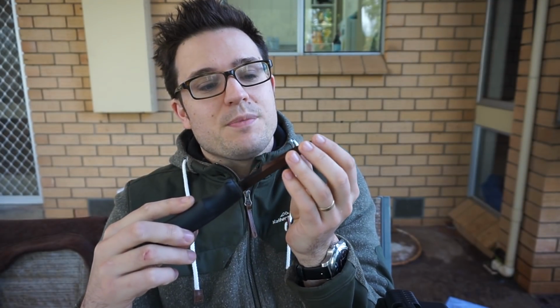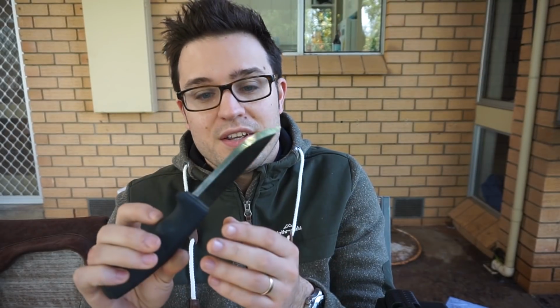Yeah, I'm pretty happy with it. Looking at it up close, there are still some scratches that if I could do it again, I probably would spend even more time at that 600 and 1500 grit. But for an edge that is more or less ceremonial only, I doubt this will, it might get an edge test and then maybe even a micro bevel again. It's got some swirly scratches, but most importantly, it's crazy sharp and it is just really nice looking.